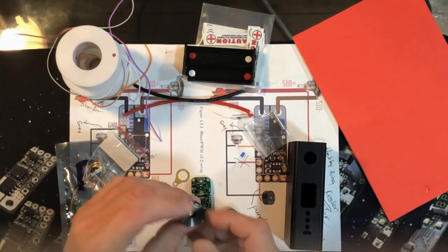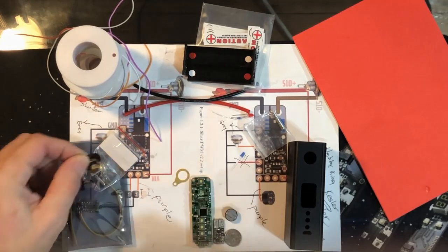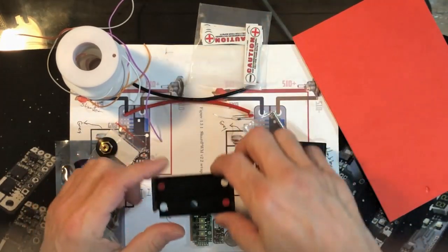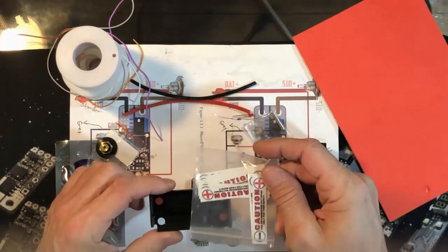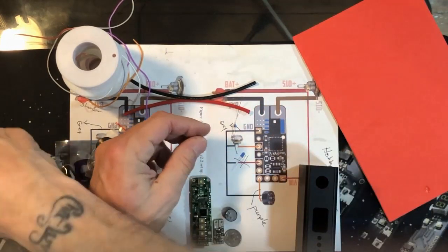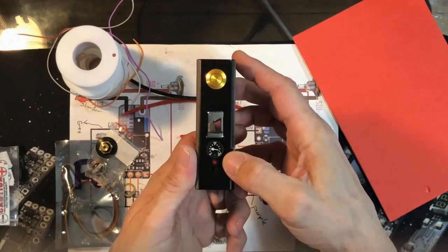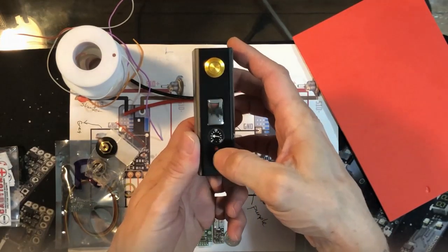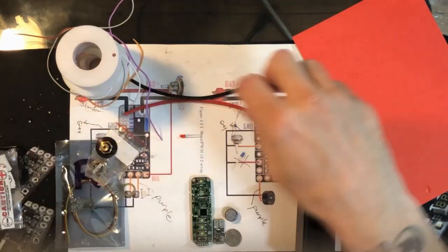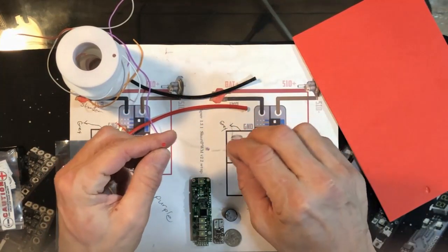We got a Ver2 fog laser engraved 510 connector, spring loaded with the ground ring, 18650 sled and polarity stickers, magnets. They usually come with the enclosure. I put an LED right here just to take up one of the holes. You can't have a big old hole down here, so I put a slide switch for that light there. You got the red LED, and I got a 150 ohm resistor.